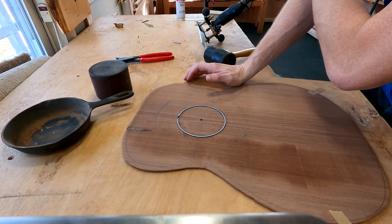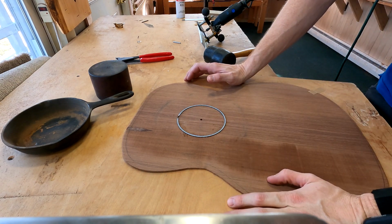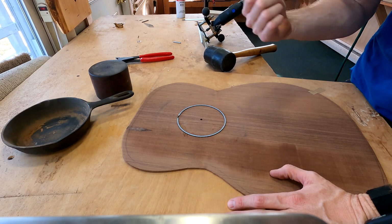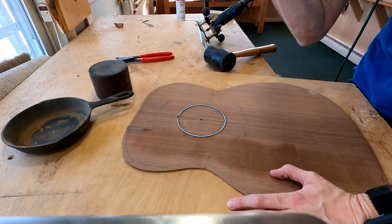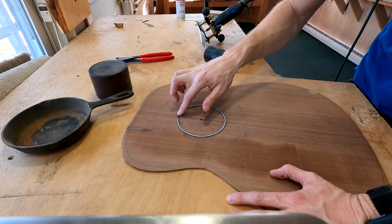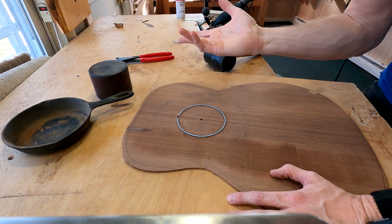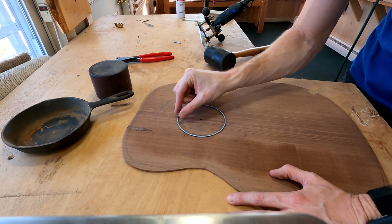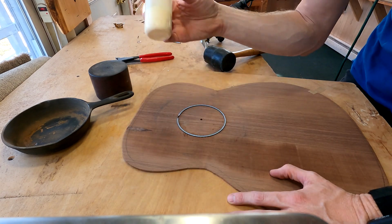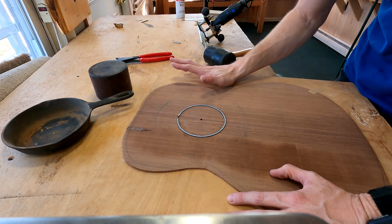That is a Teflon strip. The whole purpose of that piece of Teflon in there is for it to resist sticking with the glue so we can take it back out. It has then been like a placeholder for the mother of pearl that we're going to put in there afterwards, because the mother of pearl goes in little tiny segments, so you can't just run the wood glue, and then stick in all the pieces and these outside strips all at the same time.